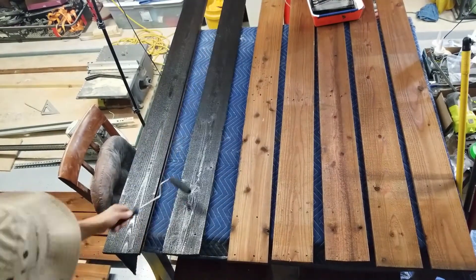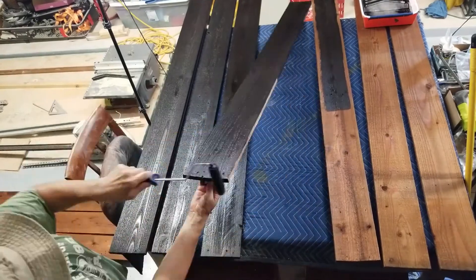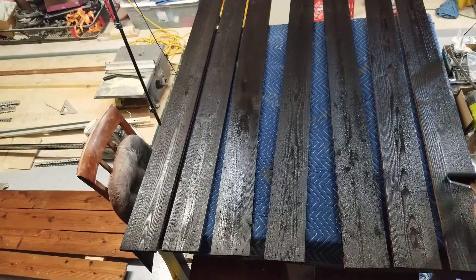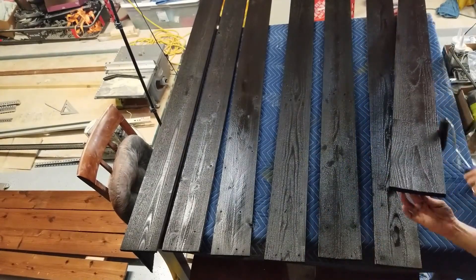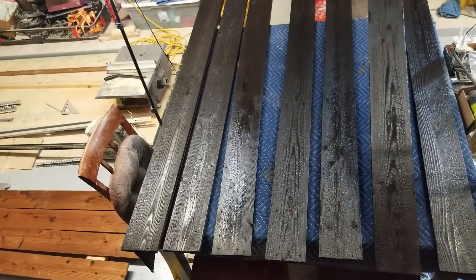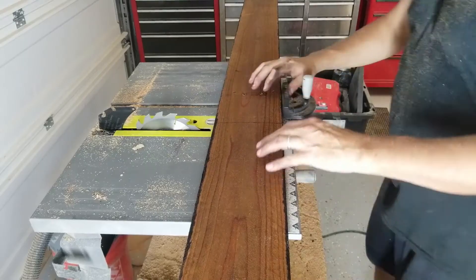Along the lower section of the outside perimeter, I elected to install a bead board using cedar pickets stained in espresso color, using a header ripped down as a foot and top to finish. This will match well with the barn red paint I selected. Once dried, I cut to fit each board staggering the ends, so I will get full use of each picket during the construction process.